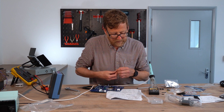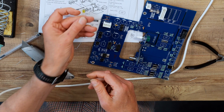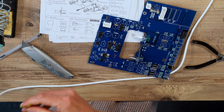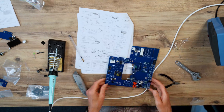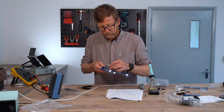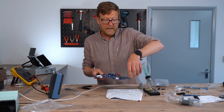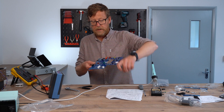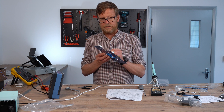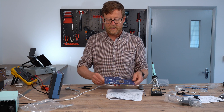So we're now on to the capacitors. Two-two-threes in yellow — I was looking for orange. Not directional, so either way around. There's three of those. There's definitely room to upgrade this kit, which we might do. But I always like to build the kit with what you get as standard and then upgrade it later, so you know what's going on and can hear the difference.